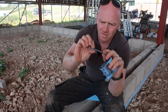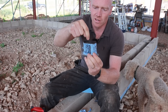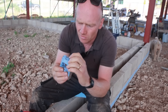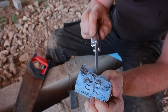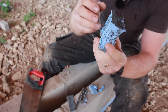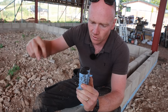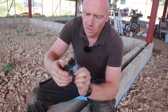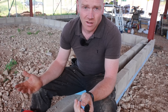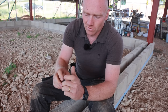I managed to snap the top layer off — that's the cement fibre bit on top, bonded to the columns. These are spaced out so you'd be very unlucky to catch just one when cutting. If you come in a bit closer you might be able to see those cement-concrete resin pillars — that's what bears the load down. So even if the insulation layer wasn't there, structurally your building would be bearing down on all those concrete columns. It's an interesting product and I don't think there are many other options out there — I can't physically see how else you could achieve it.